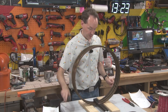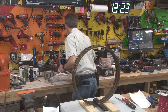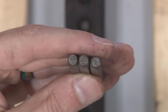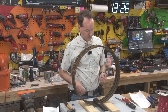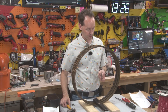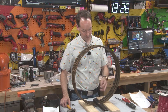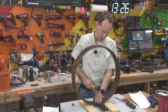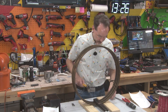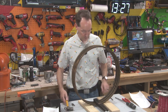Given that we're doing all new brushes and everything, the exact placement of the rings doesn't matter, but I'm going to scribe a number in each one. I've got a little stamping set here of ABC — just little cheap Amazon stamps — and this will let me stamp a letter on the inside of these so I can put the rings back in the right orientation. Going from big to the bottom, skinny to the top, so that'll be A here. This will also let me orient the rings so that I know where the marks are and right where the center piece is.